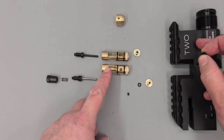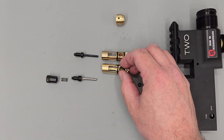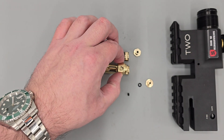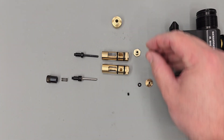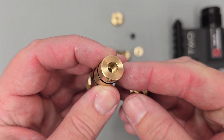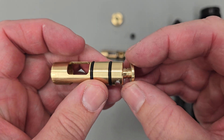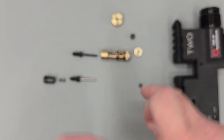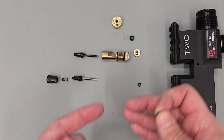To fit it all, we install the valve into the block then drop the spacer in through the top so that it sits on the valve itself. When the entire system is built up, the transfer port sits on top of that and it adjoins the three pieces. The other change is in the cap — since I didn't have an M7x1 tap on hand, I did the cap slightly differently. We have a plain bored hole and then a cap which goes on the end. The cap has a groove in it, allowing us to push it into place and then secure it using a grub screw. This cap secures the valve stem seal, which stops air from travelling through the hammer chamber when we fire the rifle.